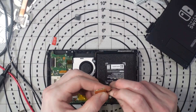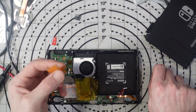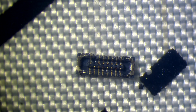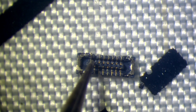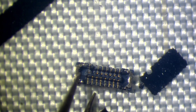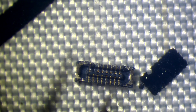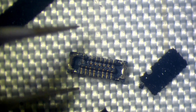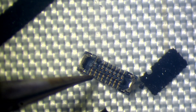The old connector was stuck inside there — let's see what the actual damage was to it. Yeah, one of the pins was missing from the SD card connector, so it couldn't have been reused. You can repair those by putting a new pin inside, but it's not worth it for the cost — it takes longer to repair than to just replace the entire connector. The solder joints had broken off because they were weakened by the leftover flux. Let's just make sure there's no damage to the actual reader — and it doesn't appear so. It looks fine.